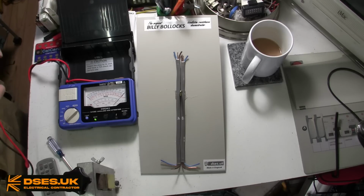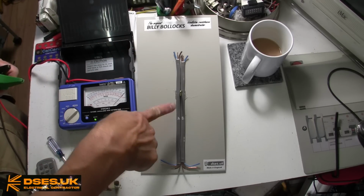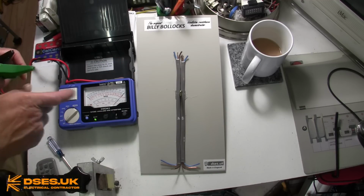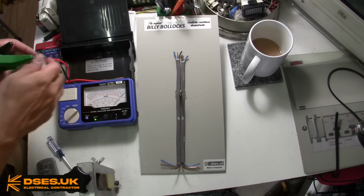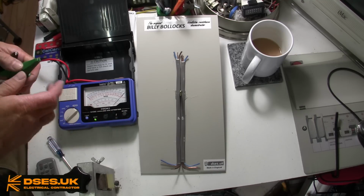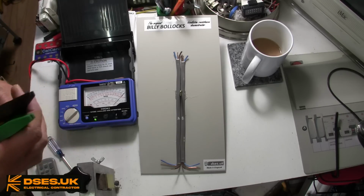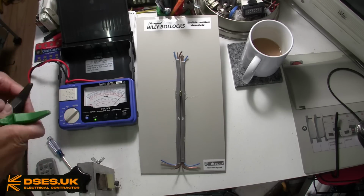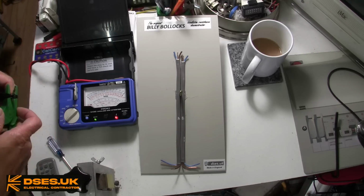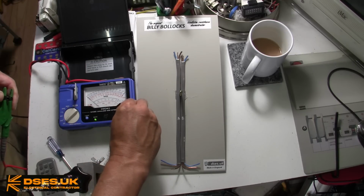Let's try it out on my Billy Bollocks here. This apparatus has two cables that some DIYing asshole has put a screw through. That screw has damaged the brown plastic core insulation in each cable, but it isn't necessarily in contact with the copper. In imaginary land, each cable is on a different circuit here, and their respective RCBOs are tripping off when power is applied. I'm going to nab a second clip from my Megger here, as Hioki are too tight to supply two, and I'm going to zero the 3 ohm setting.